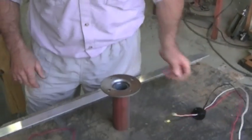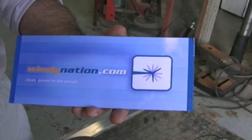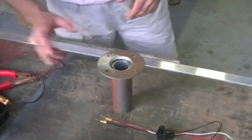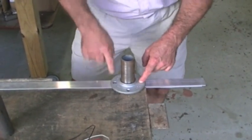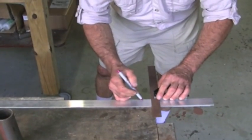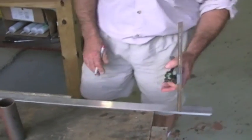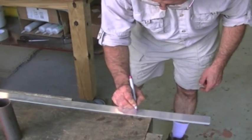Most of the parts that I am buying — the blades and the hub — I have gotten from WindyNation.com. They've been supplying me with the hard-to-find stuff, and they sell the tail boom as well. So let's get this laid out. I know that the length of my motor is around 9 inches, so we want to move back from there and lay out the holes. I need to drill two holes to mount it and one big enough for this to come up through. I've got those already marked and we'll just transfer those marks over. You want your axis to be past the motor so that you don't get in the way of all the wiring and the weight of it — you want it roughly balanced. So let's get this over to the drill press and get these holes drilled.